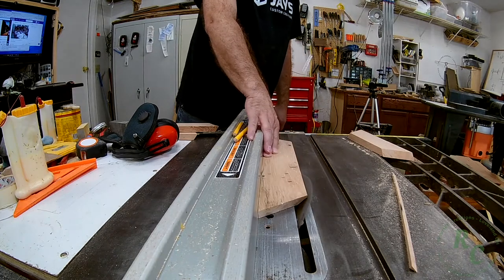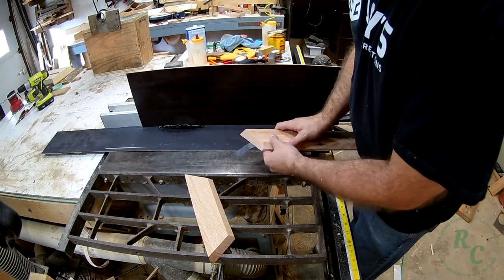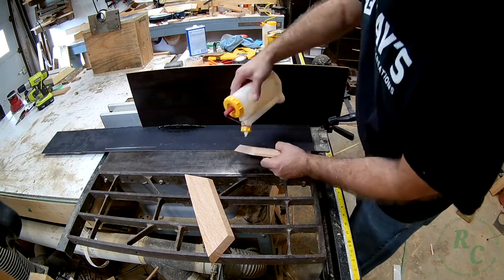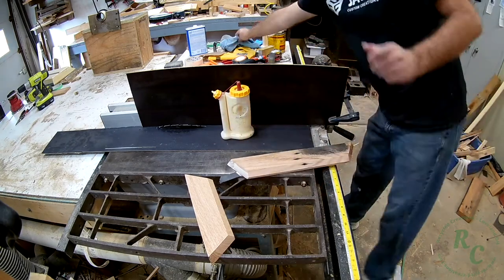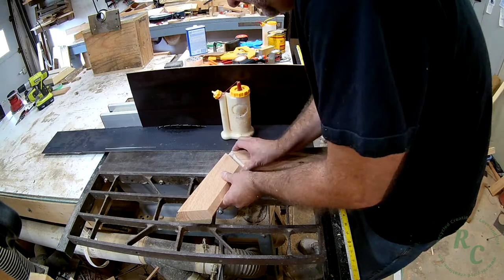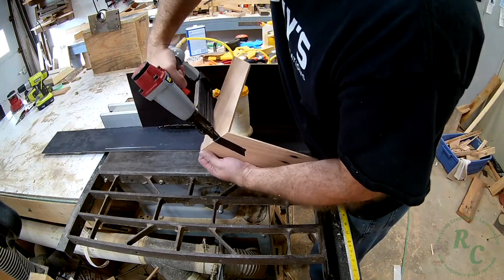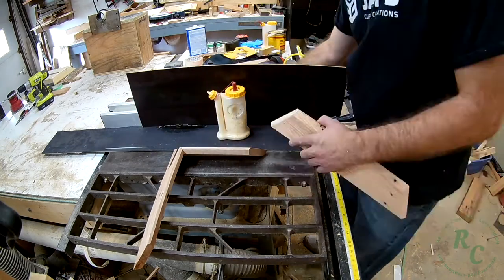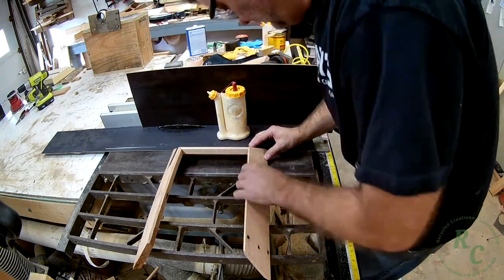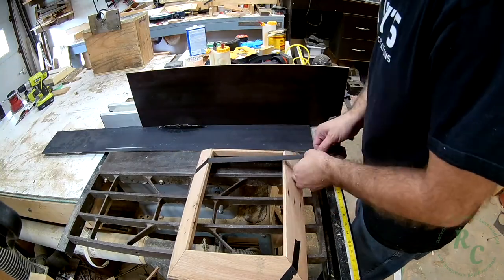Because of the setup time I batched out several of these — I'm getting ready for a craft show so I need some inventory. Here I'm starting the glue-up of the assembly. I like to use black gaffers tape for this type of glue-up; it's a little more substantial and provides a better stick to hold the whole thing together while you apply the glue, then tack it all together with some 18-gauge brads. Once you get that first corner assembled, the rest of the corners go together pretty quickly. It helps if you build the whole box out on a flat surface so you can get the front face of all the pieces even.